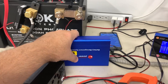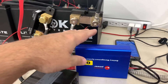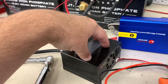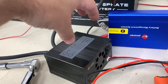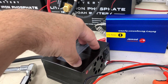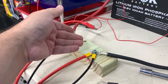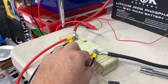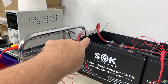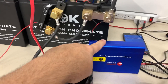We've got the BMS — this is a Chargery Power BMS, and this BMS is different from a lot of others because it's modular. You've got sort of the brains here, a display connected to the brains, and then you have a relay. This is a solid state relay, and the reason for this is if the BMS decides that there is something unsafe happening, it uses this to cut off the current. These are the terminals of my 24 volt battery and if something goes wrong, this is going to shut off the relay and no power will be available. Here is just a fuse, and these are all the leads coming in from each of the individual cells so that the BMS can know what's going on.